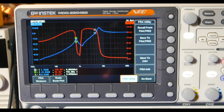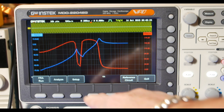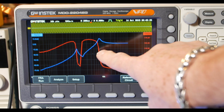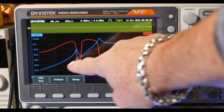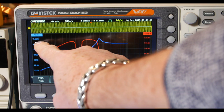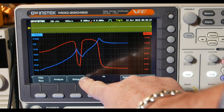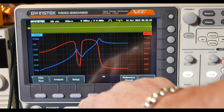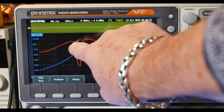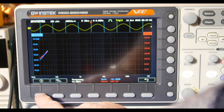I've set it up for the bass or low-frequency output. We're going to see kind of the opposite on this side — the low-frequency passes through, then drops down. That crossover point is around 800 Hz. Here's the woofer output — let's do it.